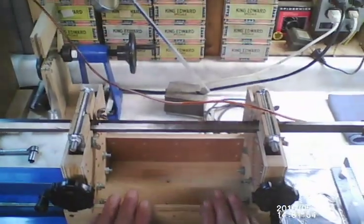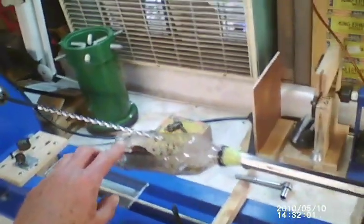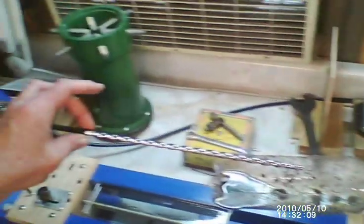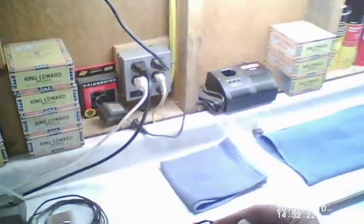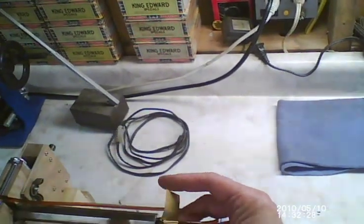We've got a carriage here that has self-centering clamps that holds the barrel centered in line with the drill bit. This is a deep hole drill bit from Brownells. There's an O-ring position right here that will stop and catch any oil, keeping it from traveling up to the chuck. The cutting oil is supplied by an IV system — an old military-type IV drip — and it goes to one end of the barrel, held in place by essentially a cork on a draped piece of brass.